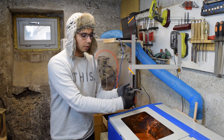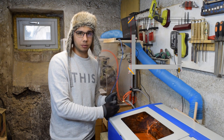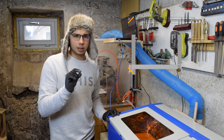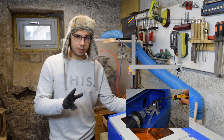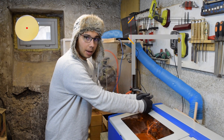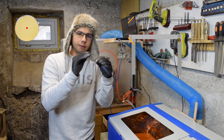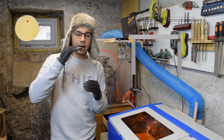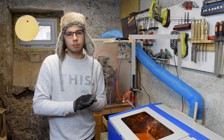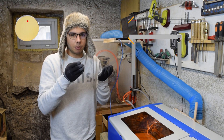Start with mirror 2 closest to you, away from mirror 1. Place some masking tape on top of mirror 2 so you can see where the burn mark hits. Set the current of the laser very low, just enough to mark the tape. Then adjust mirror 1 with the 3 screws so that mirror 2 gets hit dead center. Once you accomplish that, move mirror 2 back close to mirror 1 and fire again. Check how the dot changed relative to the first one. If the first is dead center and the second is higher, mirror 2 is too low and you have to raise it. On the original mount you put washers underneath; on my mount you just untighten 2 screws, lift it up a bit, and tighten it.